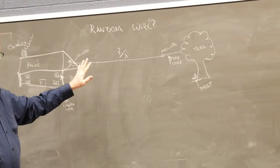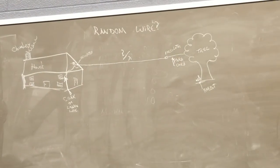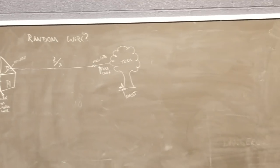Will it work on anything else? Probably not. You may get another band somewhere that it'll work, but you're always going to have to have a tuner on it, and your tuner has to be grounded. The other thing to think about is that these work pretty well for power under 100 watts. If you go over 100 watts, there's going to be RF in the shack, and it bites you in your fingers, so make sure you're grounded inside the shack for RF ground as well. So in essence, a random wire antenna is the wrong name for this antenna. It's about the stupidest name that they've given anything, to give you the idea that you can just randomly put up any kind of wire.